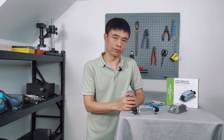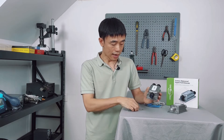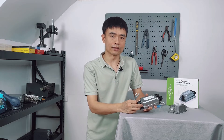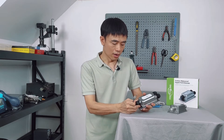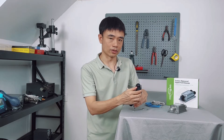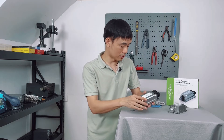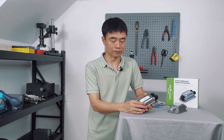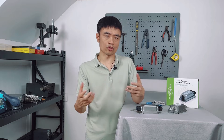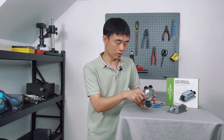The next question is about waterproofing. We plan to use this PoE extender outdoors. One important thing is to use this wrench to fasten the connector before you deploy this PoE extender. Just remember, hand strength alone is not strong enough — you need the wrench — and it will not damage the cable even if you fasten it tightly. It will never crush through your cable as long as it's copper, not fiber optic. One customer reported the PoE extender failed one month later after heavy rain because he didn't use the wrench to fasten each of the connectors.